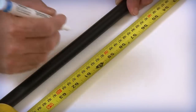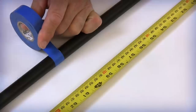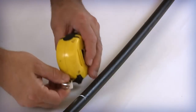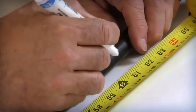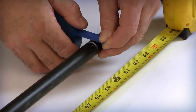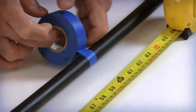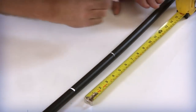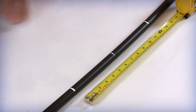From the center mark, divide the required length equally on each side and mark them using vinyl tape or a marker. For the center of the cable access loop, measure and mark the jacket approximately 6 inches in each direction with the use of vinyl tape or a marker.